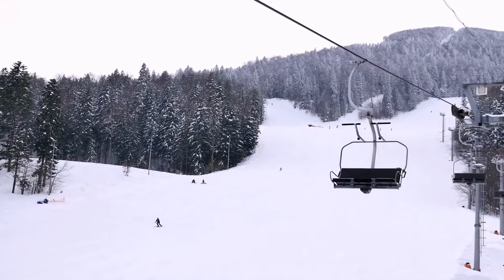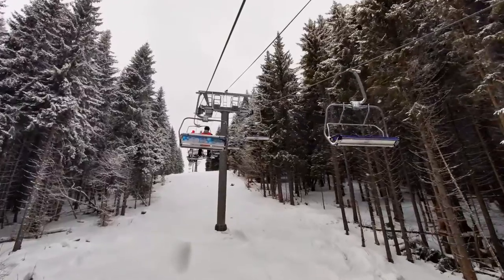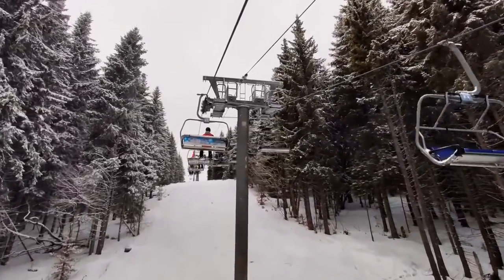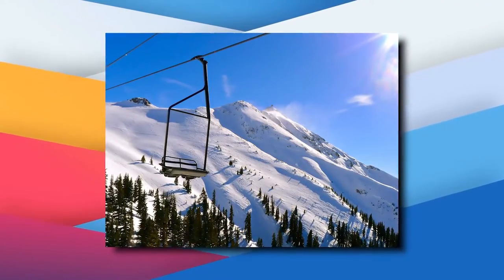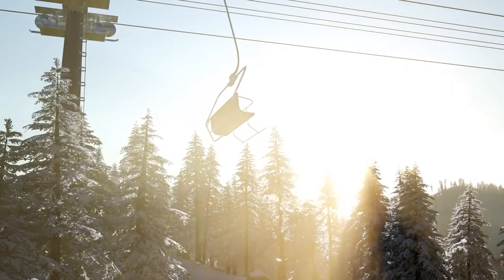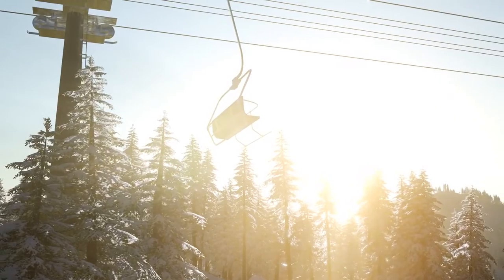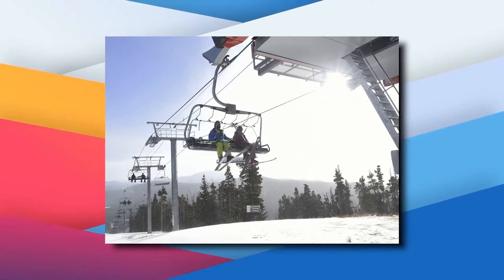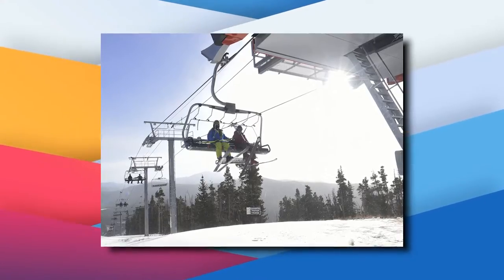Each season, a chair gradually slides backwards, which is why lines are regularly painted on the cable. The paint marks you see actually serve as a visual indicator to the lift mechanic of how far the chair has moved. If the paint mark is far away, chairs are regularly moved every few seasons to make sure there's even wear on the cable. And you've probably seen those towers that form the line — it's these towers which keep the cable from falling to the ground below.